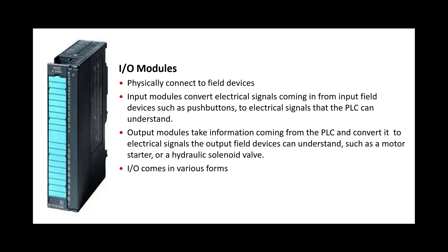These are all electrical signals, but when we talk about signals that a PLC can understand, the PLC processor can understand only digital signals. That's why we need a device to convert the field signal — which is either 4 to 20 milliampere or 0 to 10 volt — to the signal that the PLC can understand. This is the main reason that we need an input module.